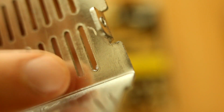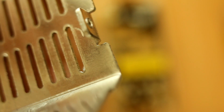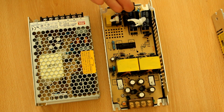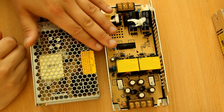And this doesn't just go for this shape of burr. Mostly, these kinds of imperfections are long, thin strands of stuff, essentially just wires, and they can short out very dangerously on the board. Compound that with the fact that there's just not a lot of protection on these PCBs, and you can quickly get into trouble, especially if you employ 10 or 20 of these, and that's what Quindor is doing.